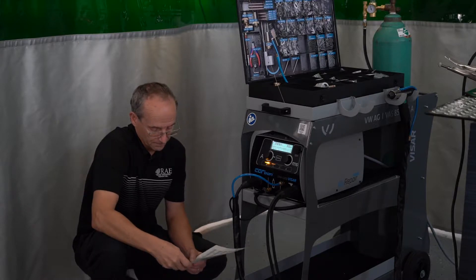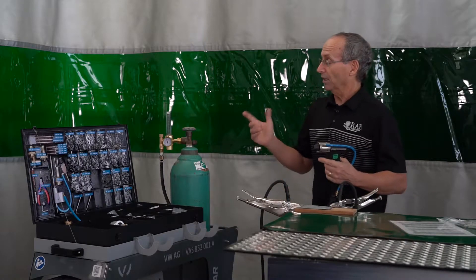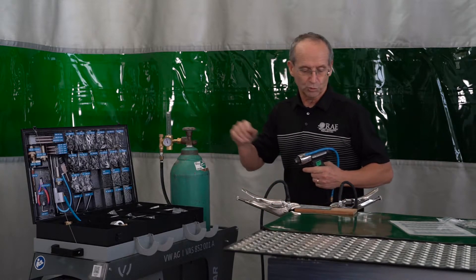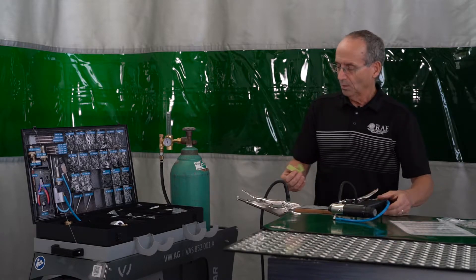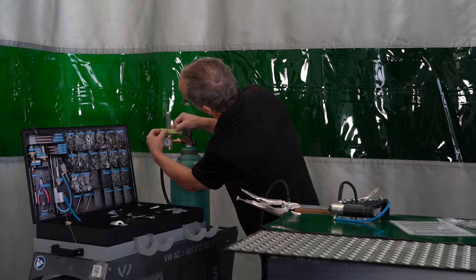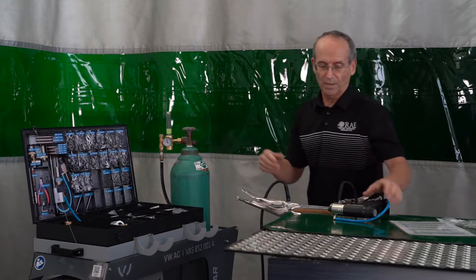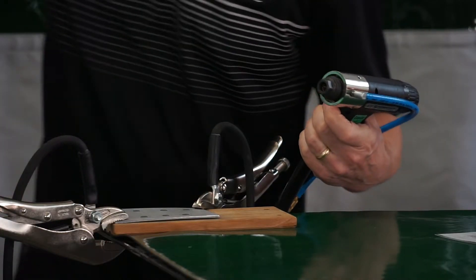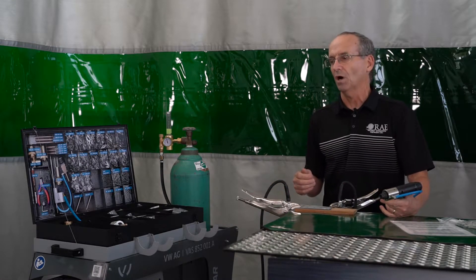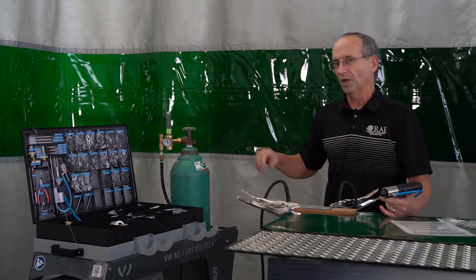The volume — we're going to check that — and we still have reverse polarity set up on the system for doing the studs. I want to check my gas, pull the trigger, and we're right at 21. Here's a little trick: take a small piece of masking tape and set the top edge right at 21 on the gauge. If you wrap it around the gauge, no matter where you stand, when you pull the trigger you can see your reading right there. 21 is going to be the same setting for everything you do on this, so the masking tape makes it very simple — stand away, hit the trigger, and you know you have your gas on.